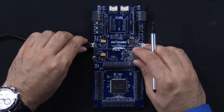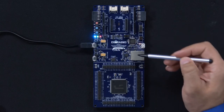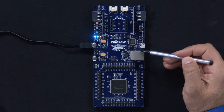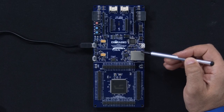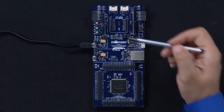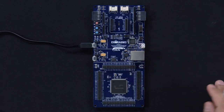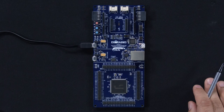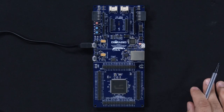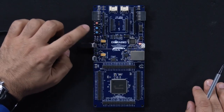We will connect the kit to the USB port of a host PC and power the kit via the USB full speed connector. The white power LED lights up. The orange debug LED lights up or flashes depending on whether debug drivers are detected on the host PC. The quick start example project flashes the blue, green, and red user LEDs upon powering up or asserting reset. The frequency and intensity of the user LEDs can be modified by pressing the user buttons S1 and S2.